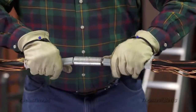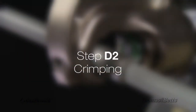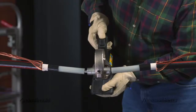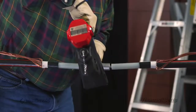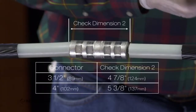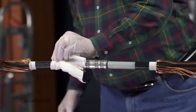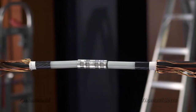Aluminum conductors must be wire brushed and immediately inserted into the splice. Be sure check dimension prior to crimping does not exceed check dimension one, otherwise redo assembly. Crimp the splice following the recommendations provided with it. Rotate each crimp 180 degrees to prevent connector distortion. Wipe off all excess inhibitor where applicable, then check the distance between cable insulations. If it exceeds check dimension two, redo assembly. Remove any sharp protrusions that were generated when crimping the splice. Metal chips and filings must be removed from the splice prior to assembly into position.